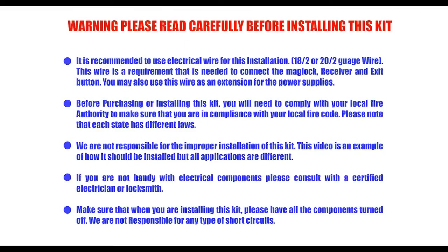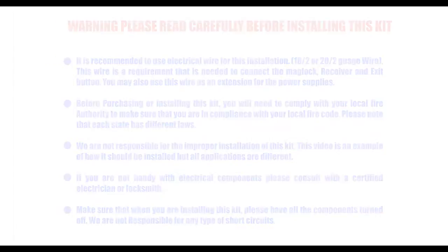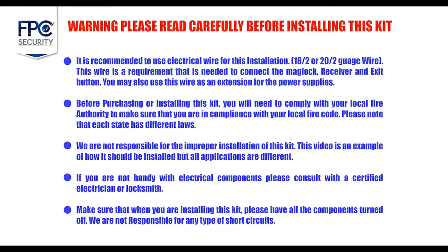Warning, please read carefully. It is recommended to use electrical wire for this installation. 18/2 or 20/2 gauge wire would be sufficient. This wire is a requirement that is needed to connect the Maglock, receiver, and exit button. You may also use this wire as an extension for the power supplies.